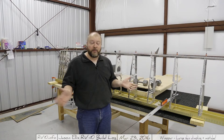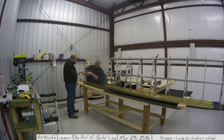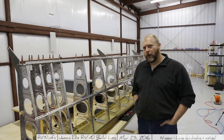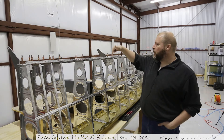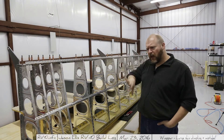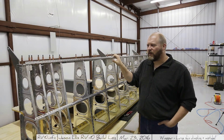I'm going to go ahead and put the skins on and begin the process. I started working on the skins, got it partly assembled, and then I realized — wait a minute, I've forgotten something. I totally just noticed I skipped a step, and I'm calling myself out on it because it was a really dumb step to skip. You'll notice I've got this rear spar back here and I've still got Clecos holding it in. As I was putting the skin on, I thought: if I put all this on, how am I supposed to rivet this? That doesn't make sense — it seems out of order.